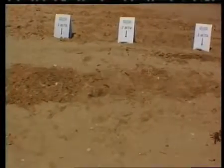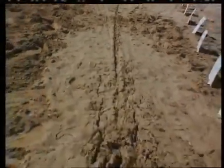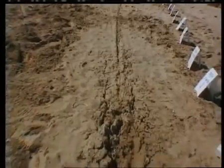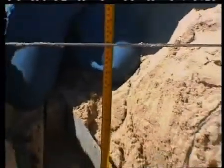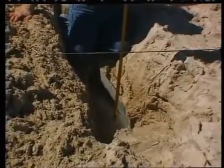The test was stopped at this point and penetration was measured. There was minimal soil disturbance and penetration was measured at 730 millimetres. The 25 kilogram Stingray anchor has safely held more than 3 tons.